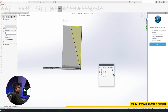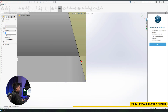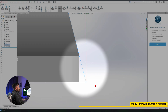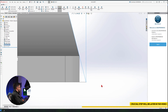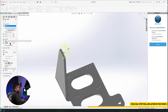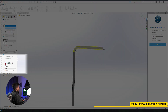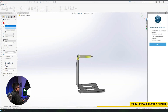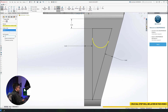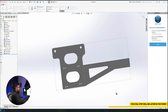Sheet metal is very, very close to normal component design. Take a look at what this sketch is supposed to cut — this bit should go away. But when I click OK, it won't. It goes in a flat way. Why? Because you cannot cut a sheet metal at an angle. I'm not saying you can't — this is just not the right practice. After here, we have another flange starting from here going 50 millimeters to the right. But as you can see, it's taller. We're already at 96 and we don't want to go any higher, so I change it to this mode where the height is inclusive, and it's 50. And there is a rectangle here.